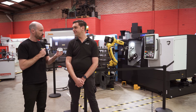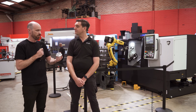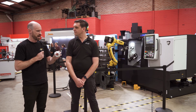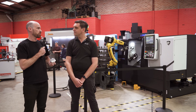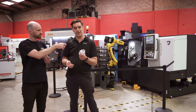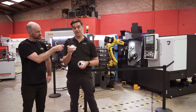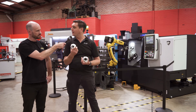This is a control part, so it's not just the supercar parts you build for your own cars, but also for the whole category. So this is a billet wheel nut. Can you talk to me a little bit about how this comes about and what machines you use? Absolutely. So this starts as a round billet of aluminium 7000 series. We put it in our DN Solutions Lynx lathe, we do all the turning features, and then we take it over to our mill to finish off these features here. So it essentially threads onto a spindle, the wheel goes in here, and the socket goes on here.